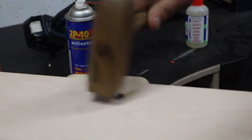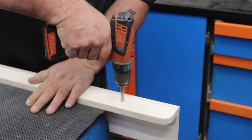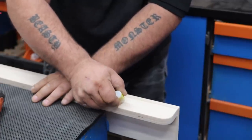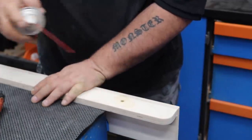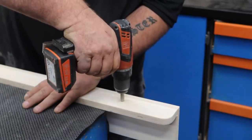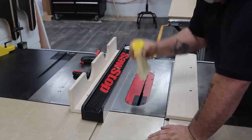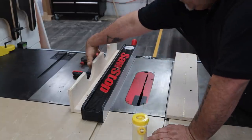The first thing I'm going to do here is chisel out a mortise for some 3/8 nuts, drive them in, then glue them in with CA glue. Now to attach the whole fence to the system, I don't need to use that much force — I just need it on there. So I'm going to run threads right into the wood and then add a little bit of strength to those by using some thin CA glue.